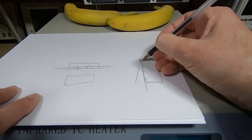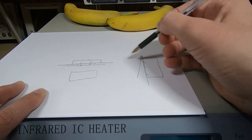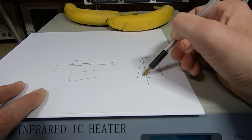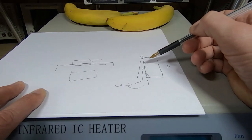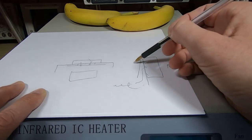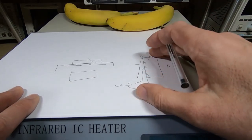and it was spot welded here at the top, and it's about 2/3 to 3/4 the width of the chamber, so air can come in, goes around the edge, through the bottom, on the underside of the tray, and it prevents air blowing directly onto the board, and it also prevents hot air escaping during the heat part of the profile. So that made quite a bit of difference.